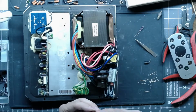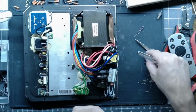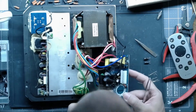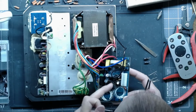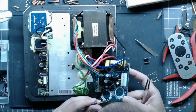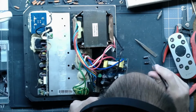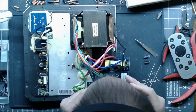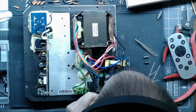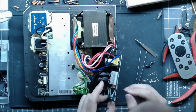And interesting that in this power supply section, these caps are only rated for 85C. They're right next to the 2 voltage regulators, so yeah, those get kind of warm. 47 and 16 volts. So we're putting 105C rated caps back in there. That should help a little bit.